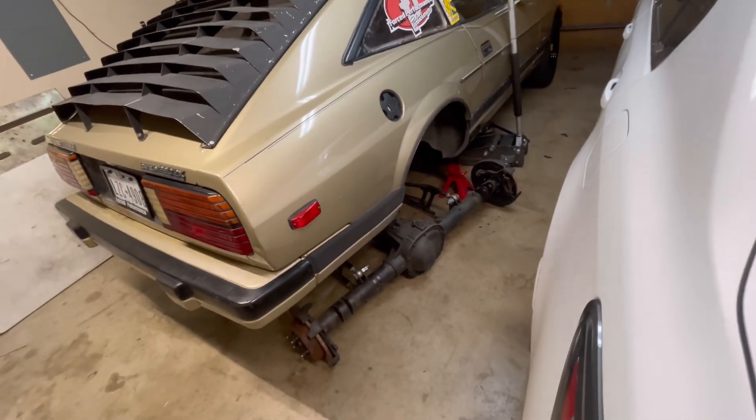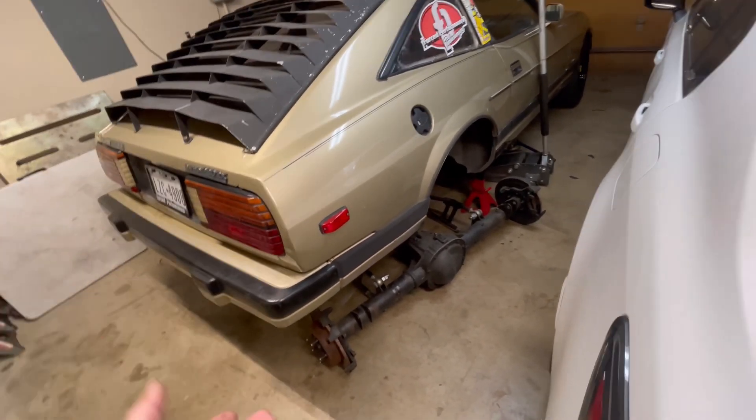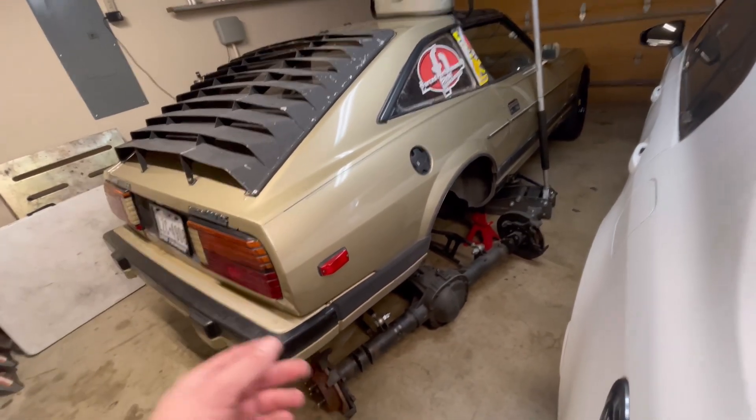I thought this was all going to be a bigger deal and the car was going to be down for a minute. I was thinking I could pull the plugs and do some compression tests and just get some baseline numbers now that the car's got some passes on it, just so I know what normal is. I'm for sure going to have to get on the alignment rack before I go back to the track. But man, this all went so easy and smooth — I'll have the axle back in it tomorrow. Maybe I go out and do some more testing this time with my laptop so I can actually get some data. I really need to work on a fast track tune and a super crappy track tune like a yellow belly and save some tune files for each, depending on what track I go to or what surface I'm dealing with. I'd even like to do some bare concrete testing with a second gear leave and a delay for commanded boost to ramp up. I kind of want to have a tune that makes this car pretty quick in every scenario, but that's going to take time.